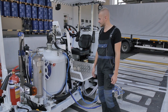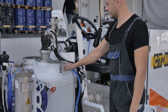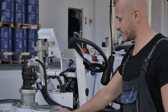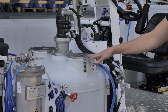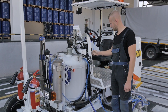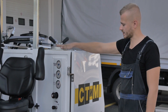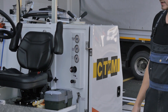This module on the road marking machine is necessary for applying paint and cold plastic. The material is poured into this container — both paint and spray plastic can be poured here. Mixing takes place using a hydraulic agitator. These are the stirrer control levers and the control lever of the agitator equipment. Reflective glass granules are poured into this container, which are sprinkled onto road markings.